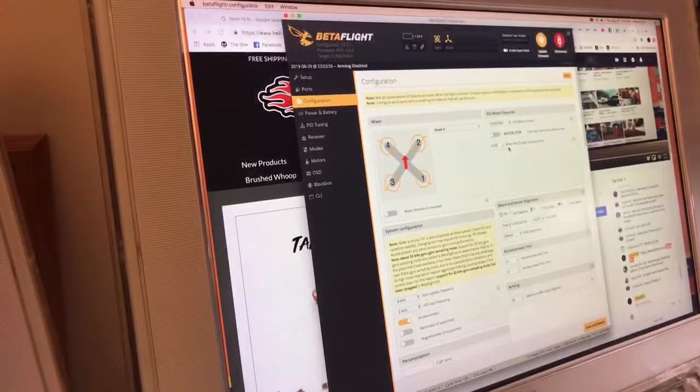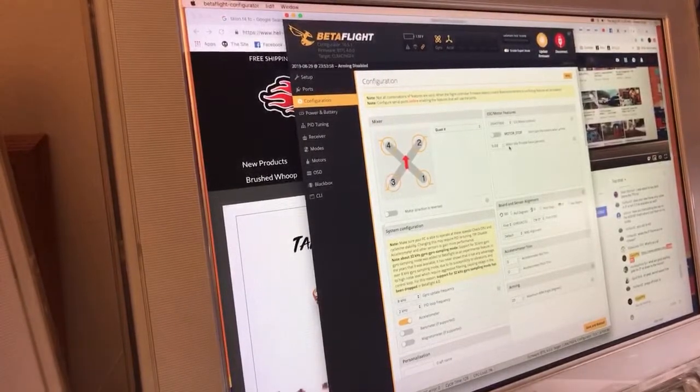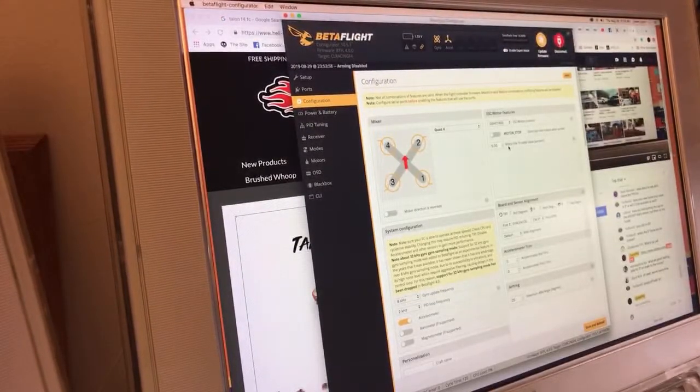The reason why, and props off. Oh, son of a bitch. I'm going to have to take these props off. Whatever. Wait, no, I'm not. I didn't switch the ESC, so I'll be fine. I think ESC is rotating properly. All that's coming through from the flight controller through their motor wires is the signal, and that's basically just power. Yeah, I'll be fine. I dropped this idle throttle percent down to 5 because I know why they raise it up to 5.5. It puts the idle at a point in the throttle where there's a little bit more power to try to get rid of that bobble when you jump off the throttle. That's one of the reasons.